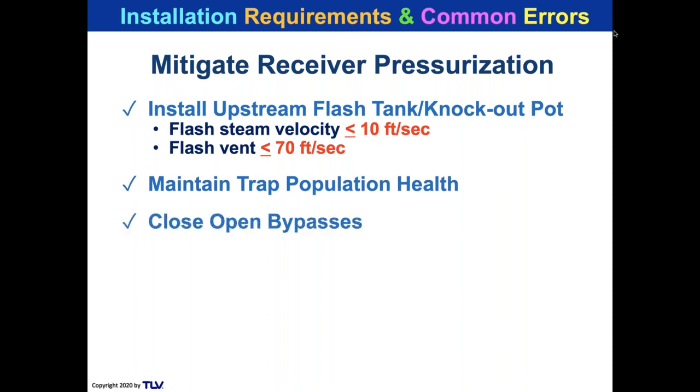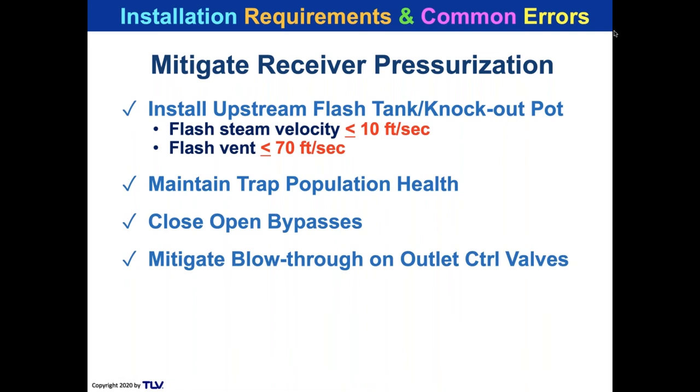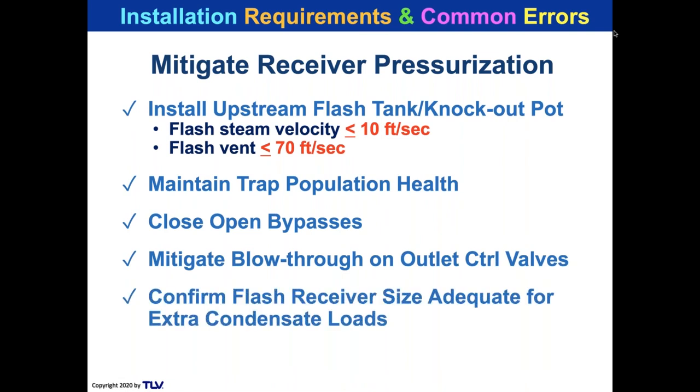And you close open bypasses on equipment. You have to find out why the bypasses are open and fix those issues at the source, and mitigate blow through and outlet control valves. And make sure that the flash receiver size is adequate for extra condensate loads when you put in a batch